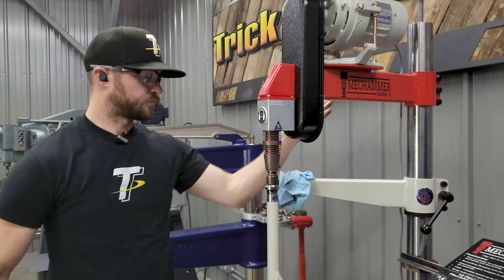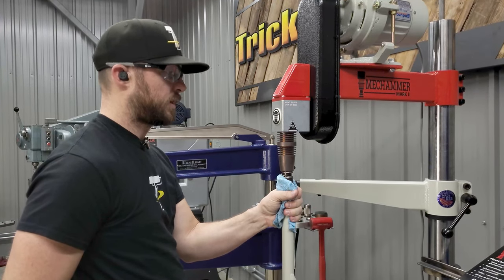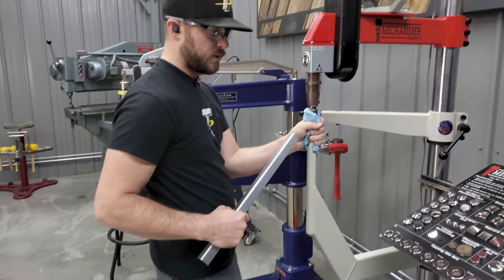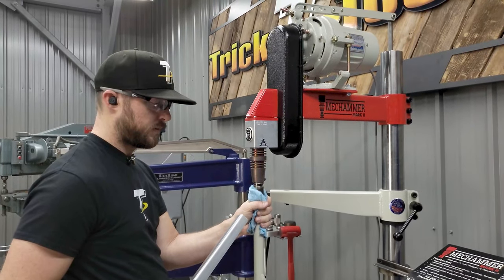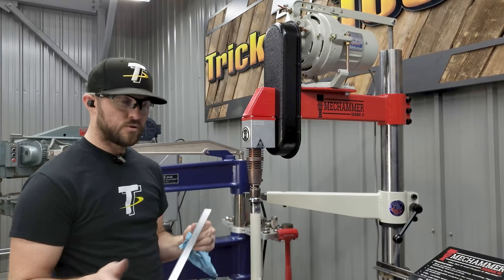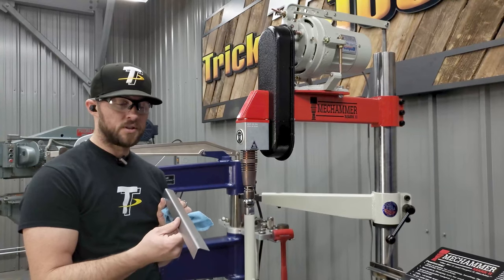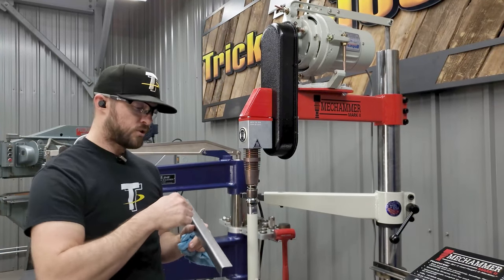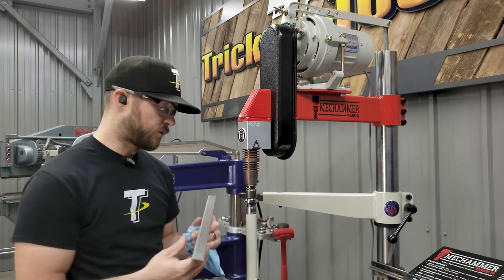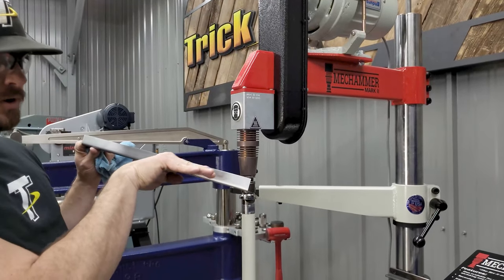On this machine, the harder you push on the pedal the faster the motor spins — you can go pretty slow or speed it up depending on your foot pressure. Linear stretching can be used on a flat panel, on the edge of a flat panel when creating a reverse curve, or just like you would use a shrinker stretcher machine, you can do stretching on a flange and actually create curve in a part that has a 90-degree bend in it. I'm going to slide this in here, work it back and forth, and you'll actually see this part start to have curve in it.